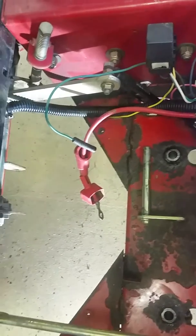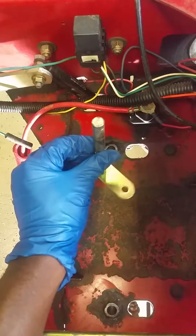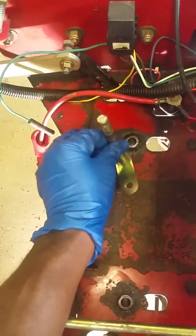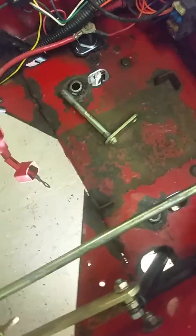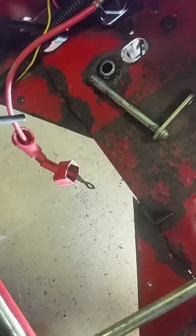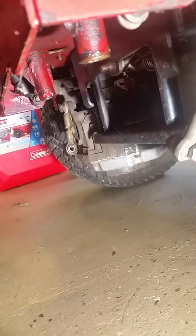Through troubleshooting — just looking down and under to see how they operated — I figured this pin would seize, not allowing the wheel motor to be activated. The pins come up from the bottom, rest in the sleeve, and connect to this assembly here, which turns the motor side to side to adjust the speed. When they're seized, the mower can't do that.